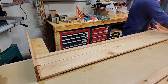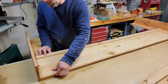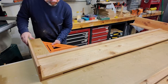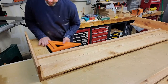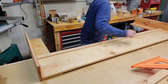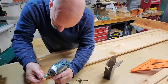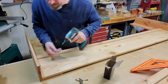Make sure the edge is flush on this corner piece here on both ends. Same thing on this side. This will be one long edge on our garden planter. What I do, just really quick, is take my speed square and just make sure my legs are squared to the bottom. Real close — it works great. It doesn't have to be perfect, within a sixteenth or so is ideal. Just make sure everything's flush, and we start screwing things down.